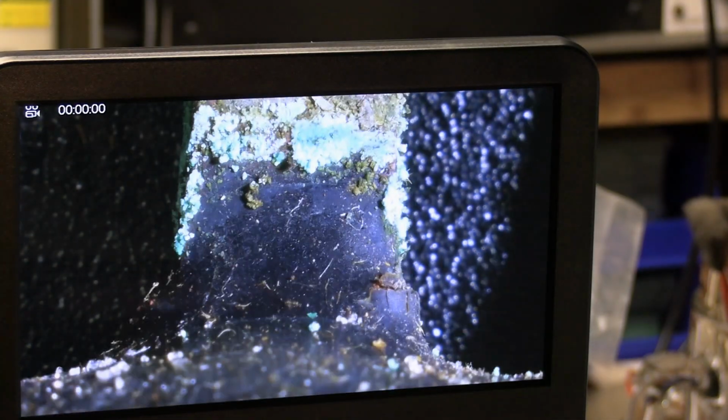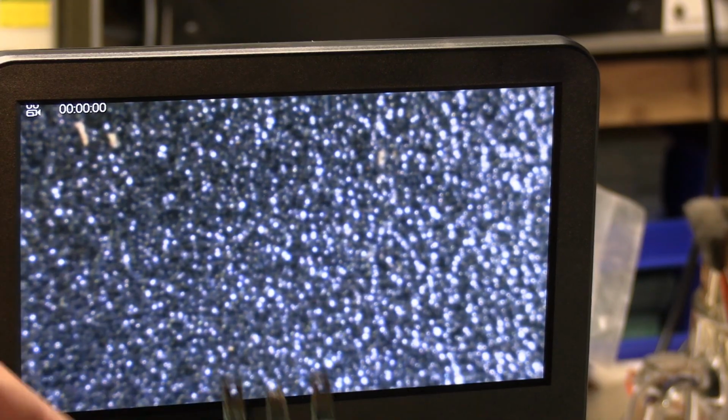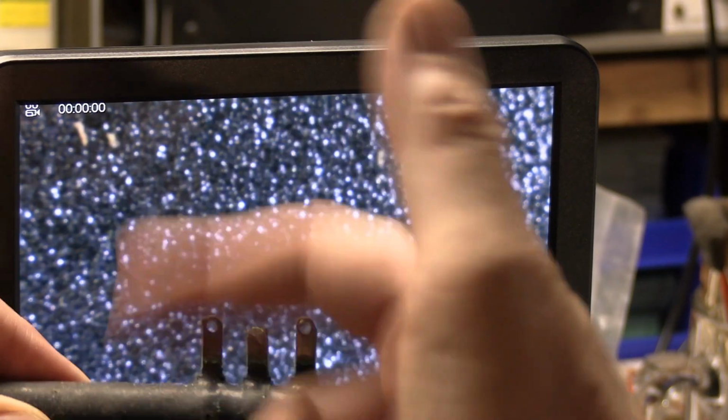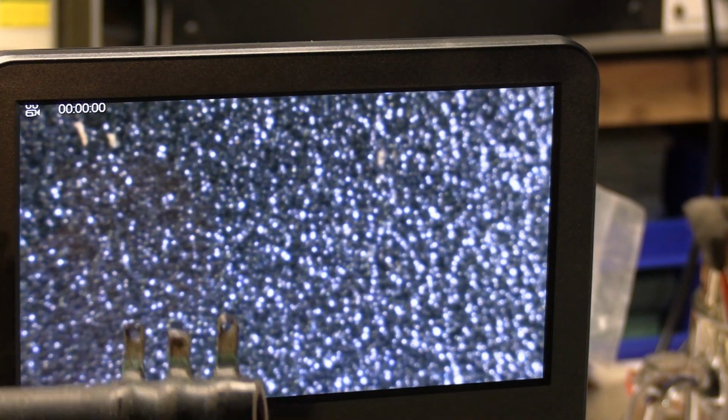What I'm looking for is, we know there's resistance wire wrapped around the body of this thing. And somewhere there is a connection from the wire wrapped around this form to this lug. It's probably underneath this coating. So let's try chipping a little of it off.